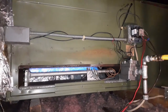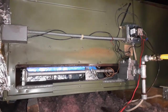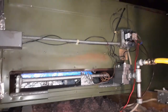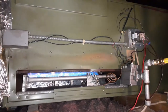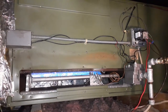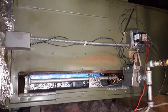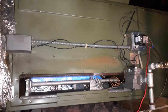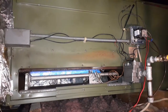After fixing the breaker, it turns out that the color of the wires on the new relay are reversed from the wires on the old one. I had to reverse two wires, and that made everything work perfectly. I had put the wires backwards — when I turned the power on to the unit, the fan came on immediately and I couldn't control the fan from the thermostat.